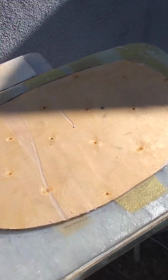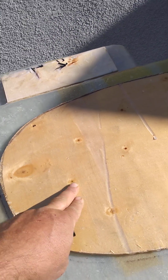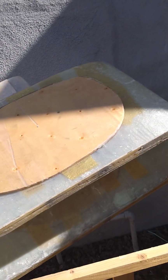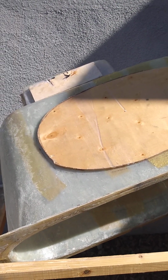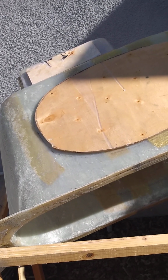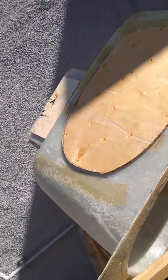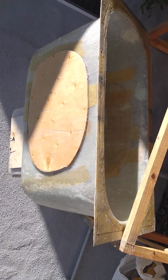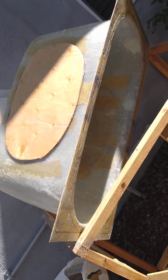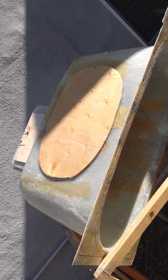It came out great. These are for reinforcement because the walls flex. There are probably so many things I could go over about what else could be used, or in addition to how many layers. This is almost a quarter-inch thick chop strand mat, and 6 and 4 ounce glass, and there are Kevlar strips. But what I found is that this is a big part. It's like 37 by 17, I can't remember exactly, but roughly something like that.